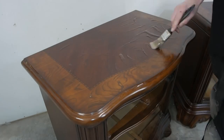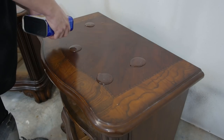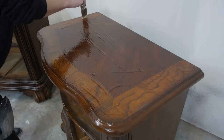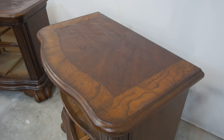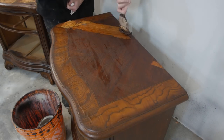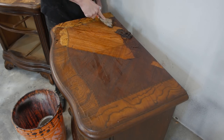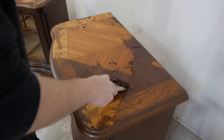I'm using a cheap synthetic brush to spread the stripper across the top. You want to make sure you get it all over the top surface, just so you know you're not missing anywhere when you're peeling it off later. Here's a 15-minute timelapse of it in action — you can see where the surface is bubbling up. Sometimes this takes a couple layers of stripper to remove the surface, but this is the first peel off.